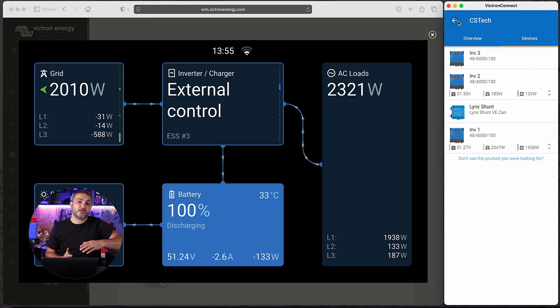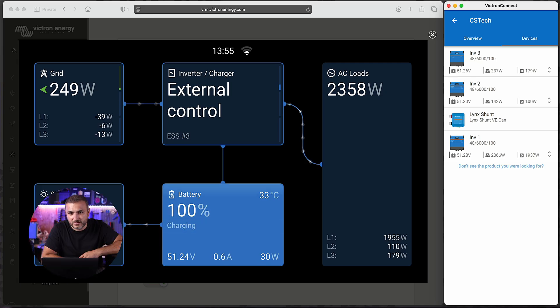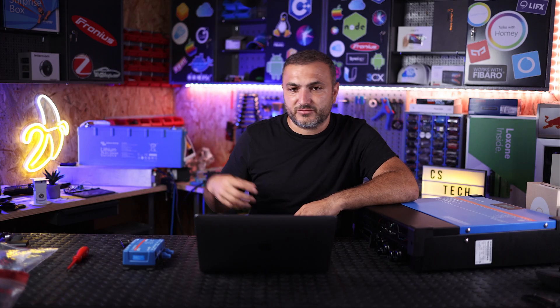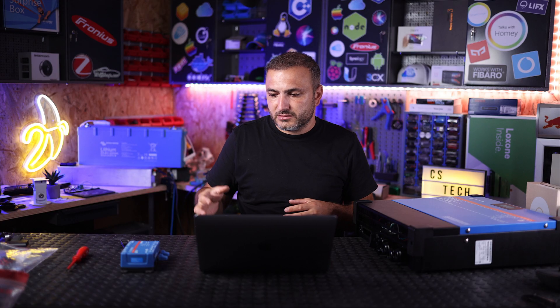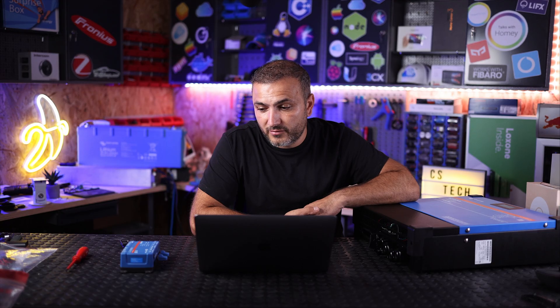In this kind of situation, we use our inverters with our software to force each inverter to feed energy to the grid based on voltage. We have an algorithm written in Node-RED, running on our servers. Our servers communicate via the internet with the Cerbo GX device, because we need to process everything server-side using our powerful servers. If communication with the Cerbo GX is lost, the entire system falls back to normal operation and respects the country code.